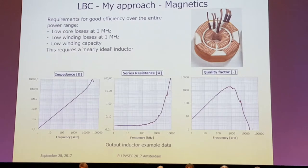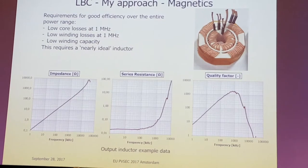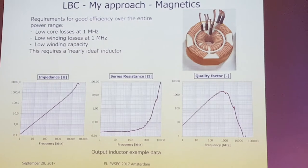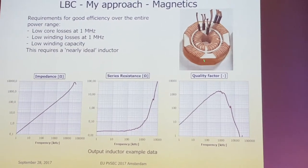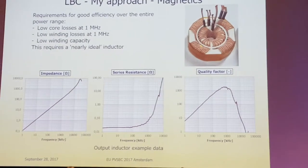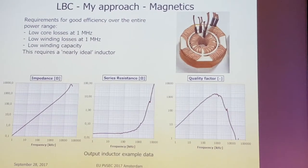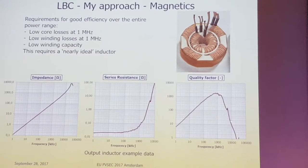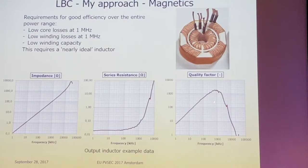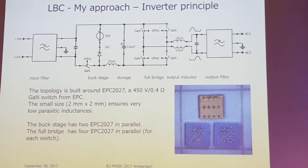For really high efficiency and high-frequency switching — which you need to get small dimensions — you want ideal inductors. Because of the topology I needed three inductors: here we have one inductor, and these other two are stacked. The trick is a multiple air gap in the design, and the precision of the windings is important. At the end it resulted in an almost ideal inductor that you can never buy anywhere — a Q factor of 2000 at the operating frequency.